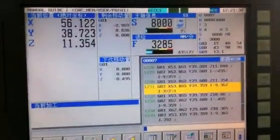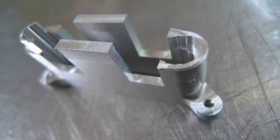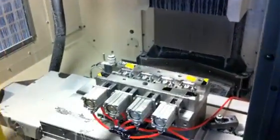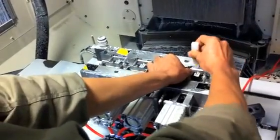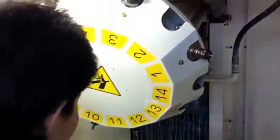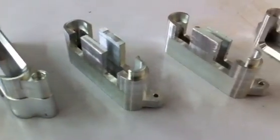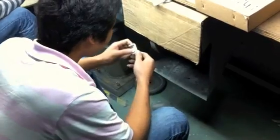The white liquid you see there - with steel it would be more of an oil, but with aluminum it's a different slurry that actually cuts down on heat and friction and keeps the aluminum and tool from burning. And there are four of the final CNC'd parts that he's taking off the tool right there. You can see the five stages that the part goes through - just in order to make the shape you have to come at it from different sides.